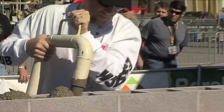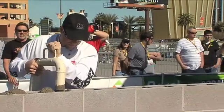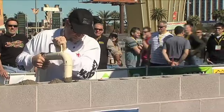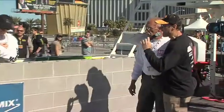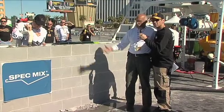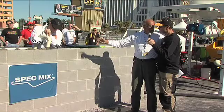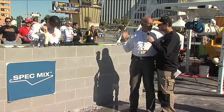Do you know how much that's actually putting out right now? It's a pretty good amount of flow, and the beauty of this is it's self-consolidating. About five and a half yards an hour. That's a lot — it has filled this thing right up and you can see it's not jerking the operator around at all. Smooth delivery and we're getting solid fill all the way up.